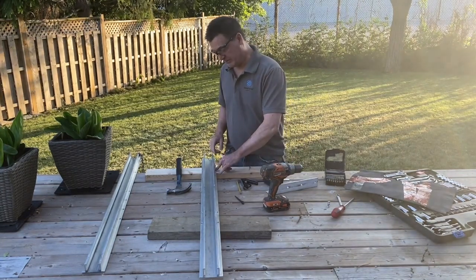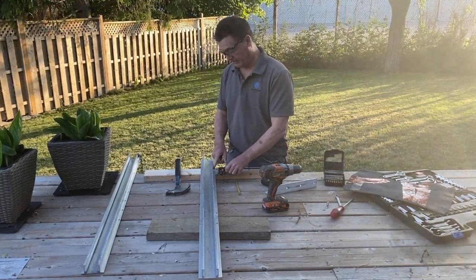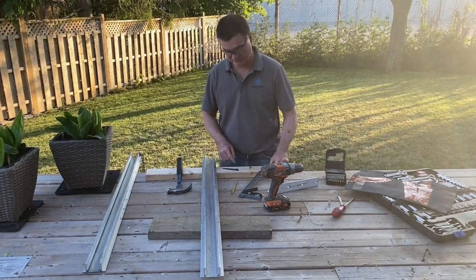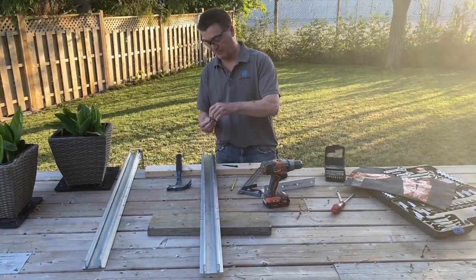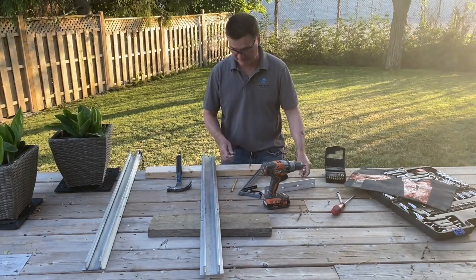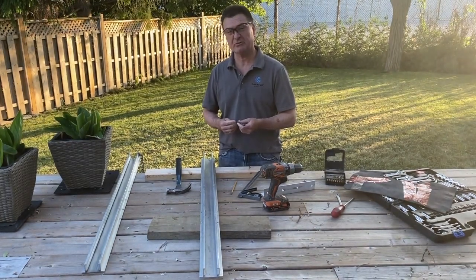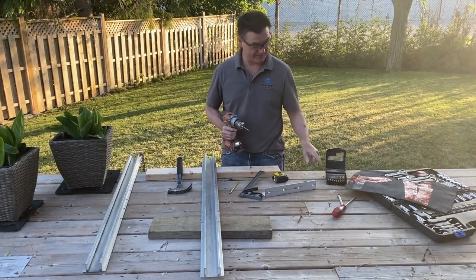I've marked a set that's down eight inches and a set that's down 12 inches. I've used my square to draw a line from the flange across on both sides, and checked to make sure I've got the same distance down from the top on both sides. The mounting bracket holes need to be in the center, because that's where you drive the screws — if they aren't perfectly centered, when you try to attach the nuts, the screws coming up from the bottom will cause the nuts to start to interfere. So it's very important to get that centered. You can buy a center punch at Home Depot — it's cheap and everyone needs one. If you don't have one, you could use a sharp nail. Start with a small pilot bit, then come back with the right size bit after that.